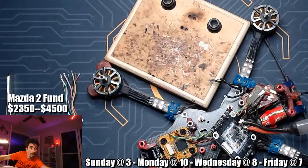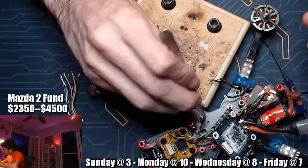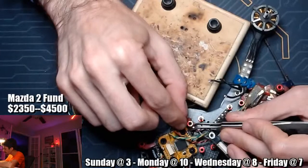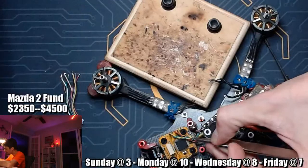Cool. So, 5-volt is on the outside. We are going to do that second. Ground is on the inside. We are going to do that first. So we're going to grab the ground wire with the tweezers, move the tip of the tweezers to where I want it, get it lined up on the pad, and then bring the heat in.